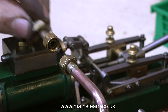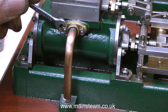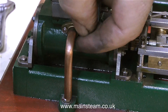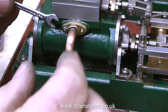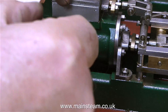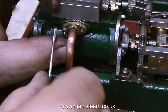In this clip I'm cleaning up both of the pipes with a piece of brass wool or wadding, followed by a brisk rub with a piece of cloth. This is one of the exhaust pipes, and unfortunately the pipes are pointing the wrong way. I don't want the pipes to point down, because I would have to put a right angled union in, and you never really want too many angles on the outlet. A steam engine is really a gas engine, because steam is a gas. The white stuff that comes out of a steam engine's exhaust is not steam — that is water vapour.